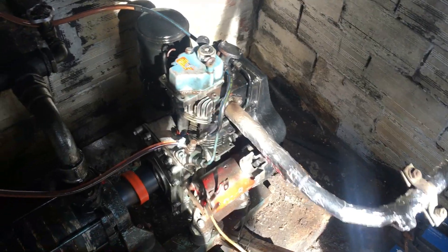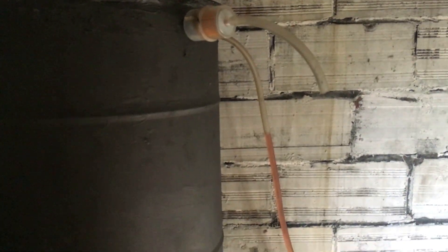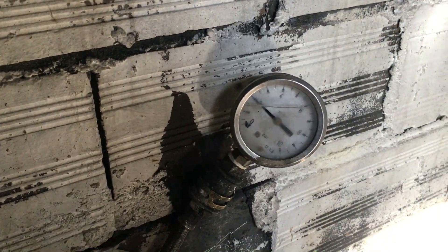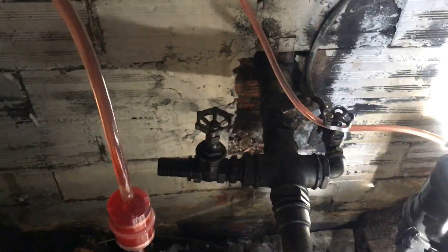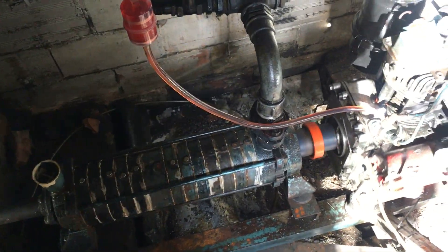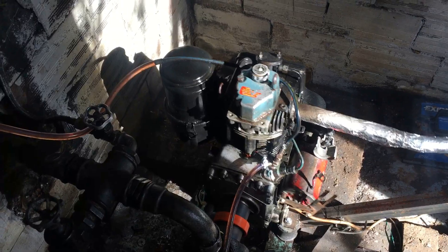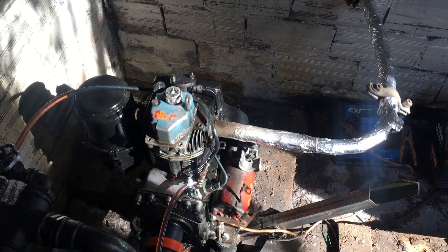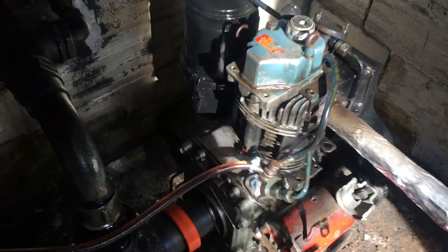The engine has a free flow exhaust, which is extremely noisy. But if the pump does work we will be fixing this in a future episode. There is a pressure gauge in the discharge pipe — it's reading 2 bars now, although I know we will need almost 7 at least, because the height difference is about 60m. You need to account for 1 bar per each 10m, plus the head losses of the fittings, the pipe and everything else. The engine vibrations are OK, although the starter vibrates a lot more because the casing it's mounted on is broken. I haven't been able to weld it that well, and I need a bolt for that spinning clip.